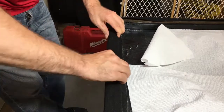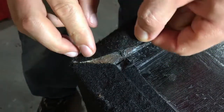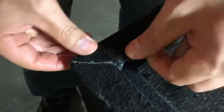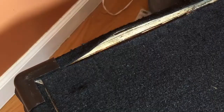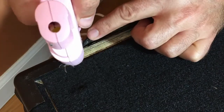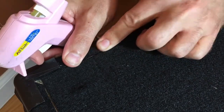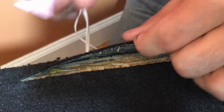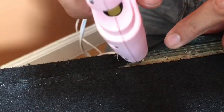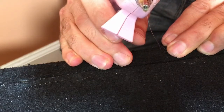Once the front face felt good, I moved on to the recessed area where the grille will fit. Out back we had some more carpet problems — the seam around the periphery of the cabinet was coming undone. I don't work with carpet too much, but I found a good way to fix this: normal hot glue. It worked great and was much faster than waiting for the spray adhesive to tack up. Just pull the carpet back, lay down some hot glue, and hold the carpet in position until the glue solidifies. Don't forget to clean up those pesky glue strings afterwards.